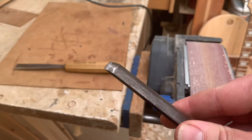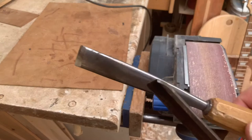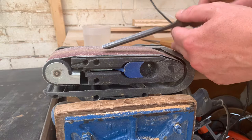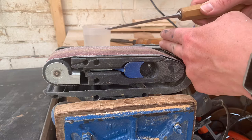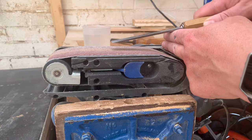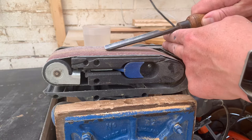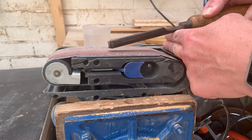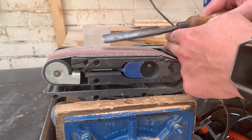So let's see if we can get that corner down and reduce this angle to make it more like the back of that. Before I even turn the grinder on, I need to know what angle to hold this at. I know that this is set at a nice angle — I like it, it works — and that is a two-finger height on there to get the correct angle. I'm not going to get protractors out and start measuring things, let's just be practical. That distance there works well. So I'm going to use a two-finger guide, and then as it's turned on I'm just going to keep rotating to make sure we get an even grind across. It's got to keep moving at all times.